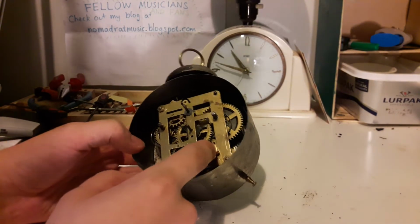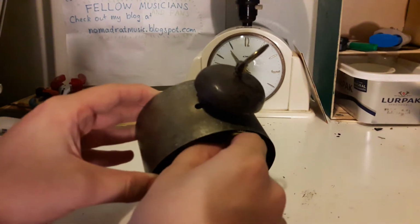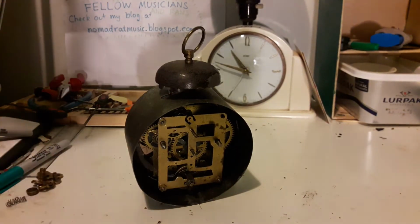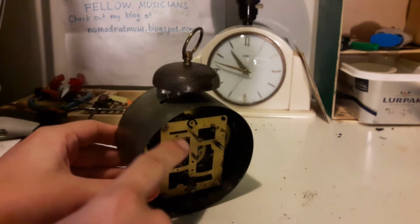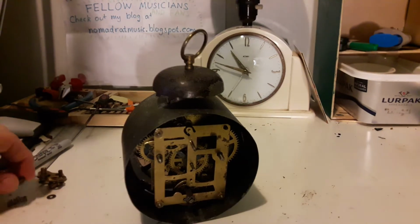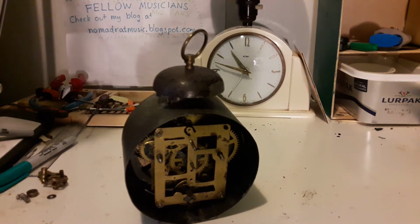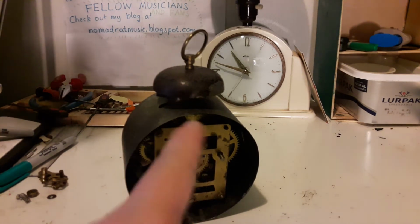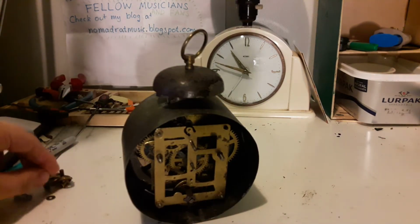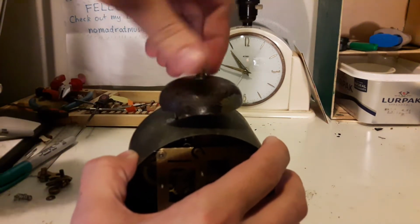And that is a Beetle alarm clock, a slightly later version of this, from the 30s I think. But it's got one of those pegs at the back instead of a bell on the top. Now this situation with the alarm tensioning is something I believe I can sort out now, because I've got a spare little bush for the alarm shaft instead of having the actual knob on the back pressing the spring together. So hopefully if we can just unscrew the bell on top.